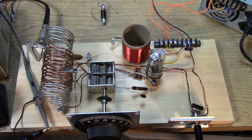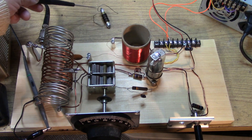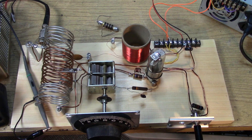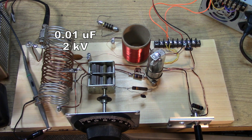The first thing you notice as you look down on the breadboard is this huge coil. That coil is the radiofrequency choke — a solenoid-wound radiofrequency choke, which takes the place of this very fine Miller choke. I substituted that choke in for the solenoid and there was no difference in power output. So we have plenty of inductance and there's no self-resonance. It's 150 turns of number 28 wire on a 2-inch form, close-wound — very similar to something you'd use for a crystal radio. The coupling capacitor is a 0.01 capacitor.